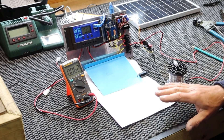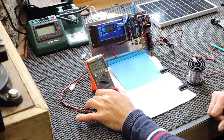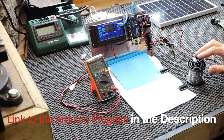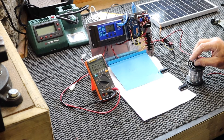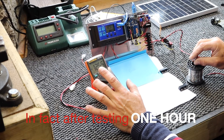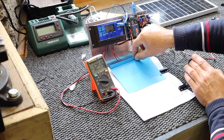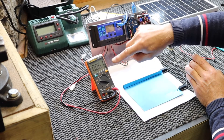Here's a short demonstration of the automatic door opener. Instead of the motor, I'm using my multimeter to show the voltage that will be put to the motor when triggered by the program. At the moment it's zero volts — the door is open and it's daylight. Here is my photoresistor. When it comes to nighttime, I'll cover it with my finger. It'll delay — longer than shown here; I'll set it to about 10 minutes in the real program. Now it's set to 12 volts. I'm going to slide the door down, releasing the upper switch. It's going down, going down — and now it's closed. It hits the lower switch and goes to zero volts.